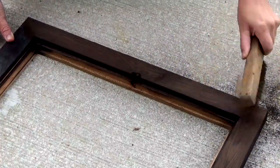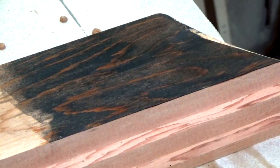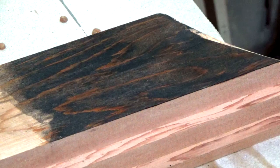So I ran an experiment on a test piece, and I found this really interesting. This section here is the brushed Shou Sugi Ban — you can see it darkens the rings of the grain but not so much the growth wood in between. Over here I put on some penetrating ebony wood stain. Here you can see it darkens the growth wood but not the rings.